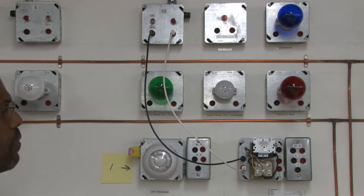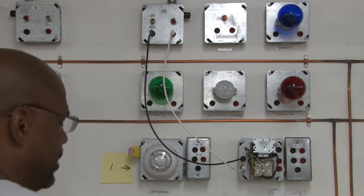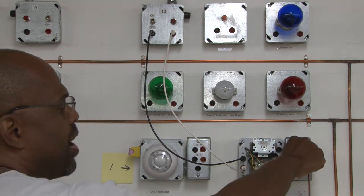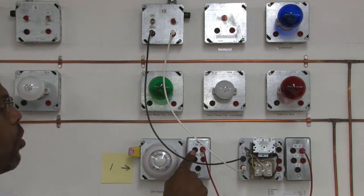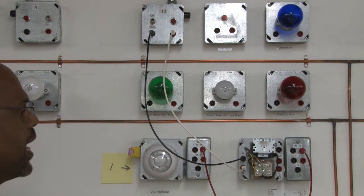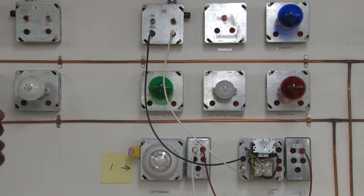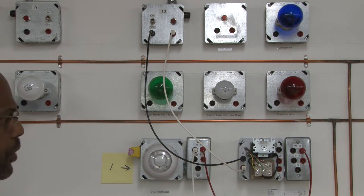The way we're going to run this, we're going to take power out of the transformer and go from the R terminal, which is the power coming out of the transformer — the hot side. We're going to go into the switch, or the thermostat. The R terminal goes to the R terminal of the thermostat. We're going to control it by coming out of a switch which is controlling the heating circuit, which is the W terminal, and we're going to go into the load.